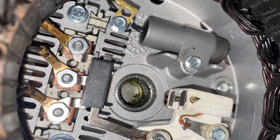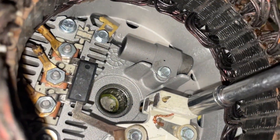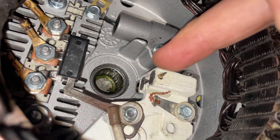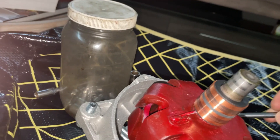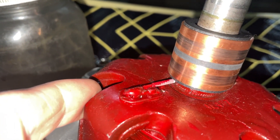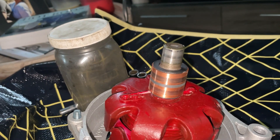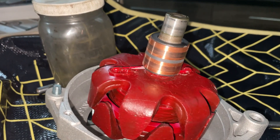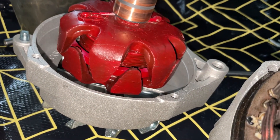There are the brushes — you can see the nail sticking up here, so the brushes were held in perfectly by that nail. Wonderful, this looks like it's going to be pretty easy. A little concern is that there's quite a bit of wear on the commutator. Didn't expect to see that, but maybe that's normal from the testing procedure they use on these when they're rebuilt.